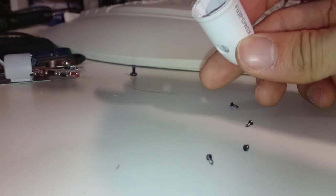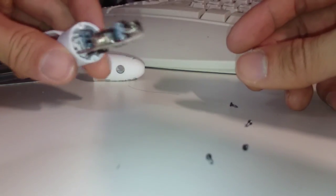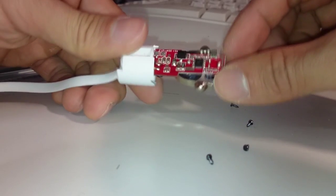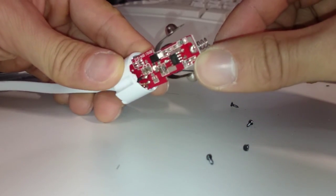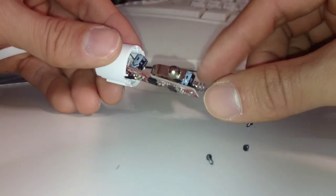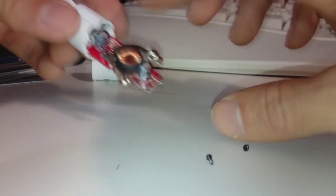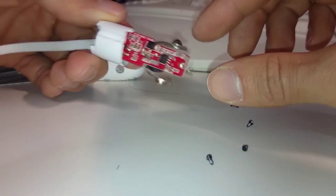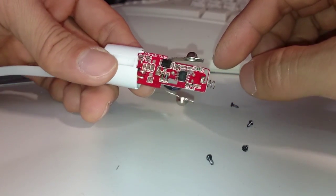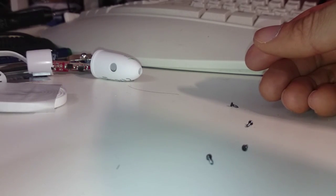I'm really disappointed by this design. I also don't know what kind of fuse they used — it seems to be all SMD surface-mounted devices, with a couple of electrolytic capacitors at 35V and 16V, and a Zener diode. But I don't see any fuse. There could be some kind of fuse in the IC packaging, but I don't see it here.